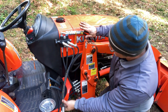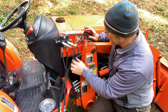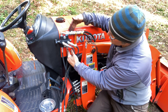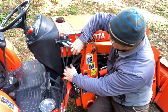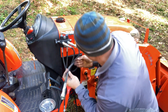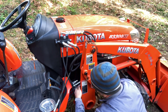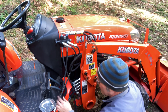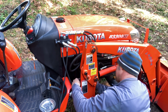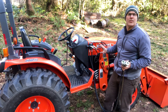That's looking pretty good. I really like the routing of these hoses. If you take your time you can really get it looking professional. The front set of three outlets on this switching valve is white, so I'm going to take this coupler right back to the white coupler on the tractor side. Take your time to find a routing. The rear one goes to yellow. The connection to the loader hydraulics is completely finished.